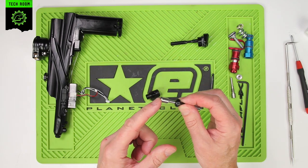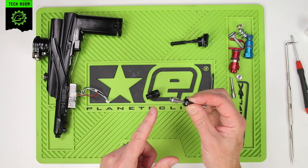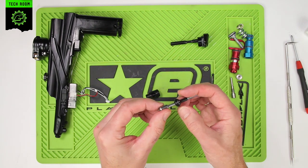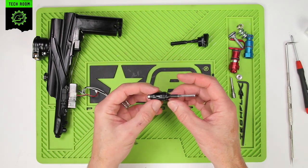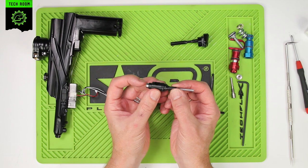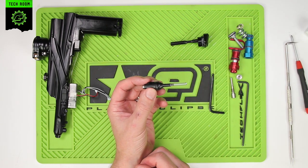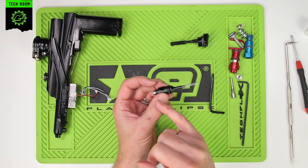Also look at the face of the exhaust valve — this is where the lever works. Make sure that's not too worn; it will wear over time, but this relatively new gun has no signs of wear. Also check the sealing surface around here that mates up with the valve guide itself. This is the main poppet valve — it gets pushed open and allows air to travel through from the firing chamber into the bolt. This valve is normally closed. If there's any damage to either of the two sealing surfaces, you will get a hiss and a leak down the barrel.